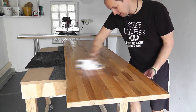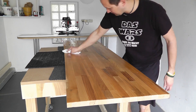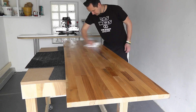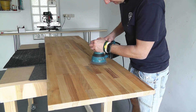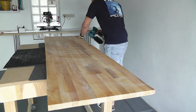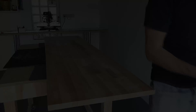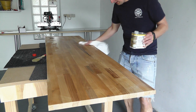After around about 20 minutes, you can remove the oil overflow. Now, if moisture is spread on wood, the fibers stand up and result in a rough surface. Therefore, I sanded the countertop again with 320 sandpaper. Then I re-oiled the countertop — this time though, I only used a moderate portion.